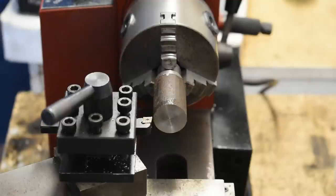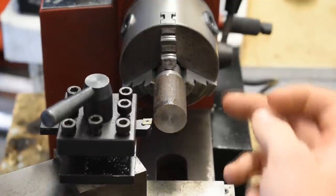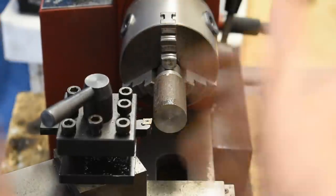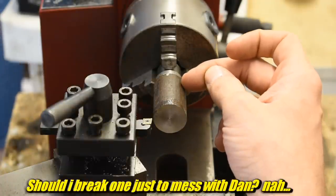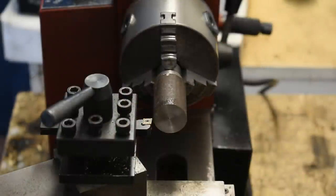You'll hear it. Then all you've got to do is just back off and then take a nice easy cut, just keep going in. We've got this nice little ridge here because these guys are really hard — against that it'll just snap right off and we don't want that. Feed right in and stop when you get there. If you stop early that's okay — just let go and we can evaluate, because this will hold everything right where it is, you won't lose your cut.